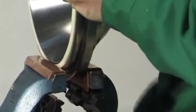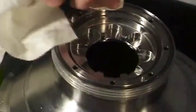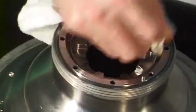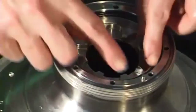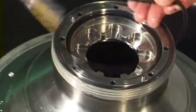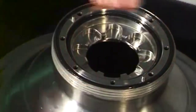Then, pull the gasket bit by bit into the groove with the vise. Use smooth copper jaws only. Drive the gasket into the groove so that the sealing surface of the gasket doesn't protrude by more than 0.5 mm from the surface of the bowl top. Clean the grooves for the gaskets in the bowl top thoroughly. Check the gaskets and replace if damaged and fit them.